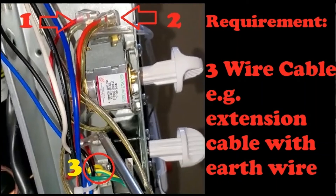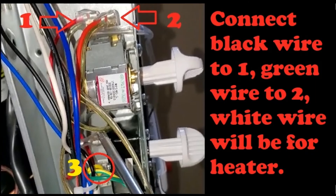These three wires will go through a flex conduit and into the gadgets box. They should be of different colors and should be flex wires, not hardcore wires, because there will be some bends and flex wires are easier to manage. I had a broken extension cord and used its cable for my connections, which had different colors: one was black, one was green, and one was white.